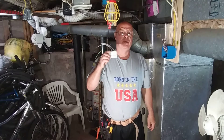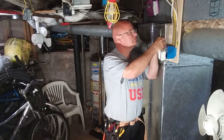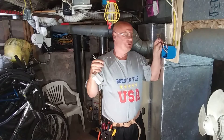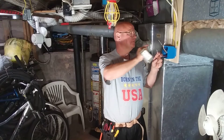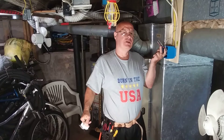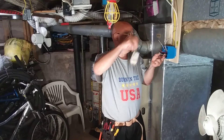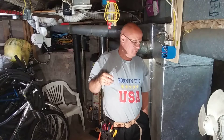Alright, how is everybody doing today? We're going to hook up this feed-through GFCI with the pigtails on it. What we have here is a 14/2 going to the light, a 12/2 going to the outlet outdoors, and a 12/3 coming in. Black is the 20 amp circuit, red is the 15 amp circuit for the light, and we're sharing the neutral. We'll start wiring this together — first we'll take a red wire nut.